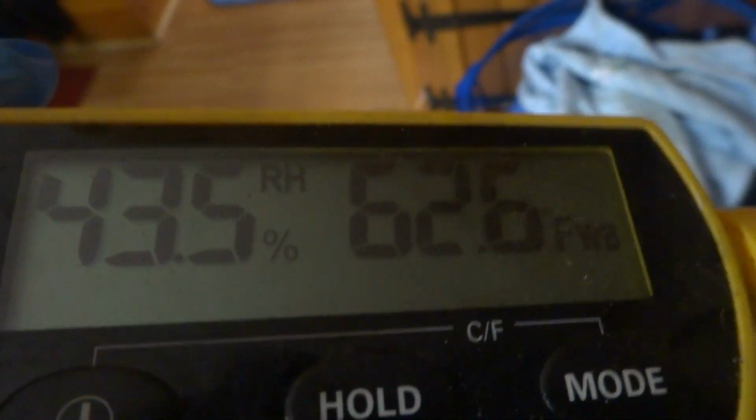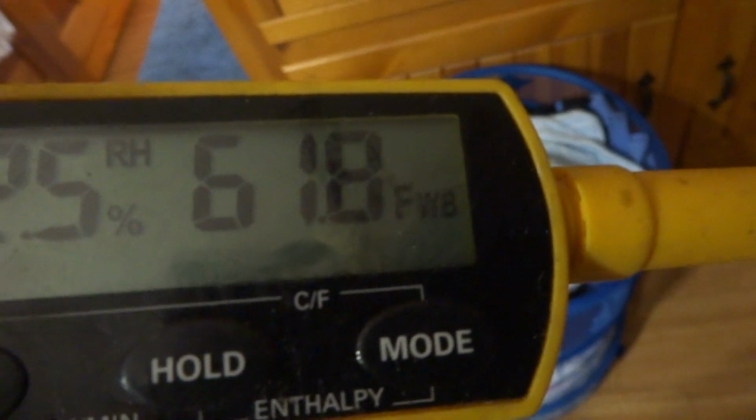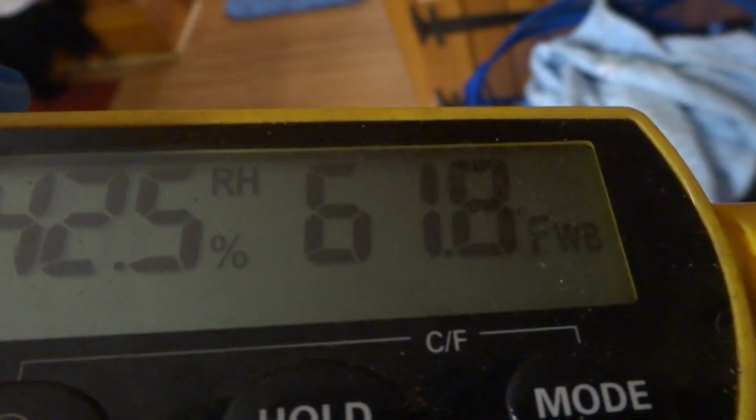You. Definitely going to work better now. Huh? I cleaned the coil outside. Yeah. The secondary pan up in the attic was full of water, but you see me drain it out. Right, you're not supposed to have water in there. It might have iced up. I cleaned the drain out. Yeah. And I'm putting Freon in. I cleaned the outside coil. Okay. I had to change one of the Schrader valves outside that was leaking a little, so I changed that. Oh, thank you. So we'll set the charge and we'll let it go. I mean, it's older equipment, but it's still working, right? Yeah. I changed the filter upstairs.